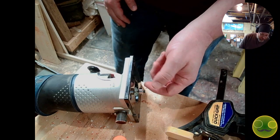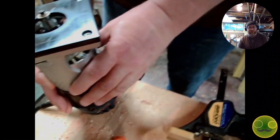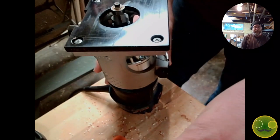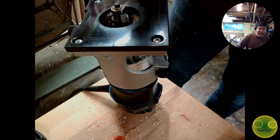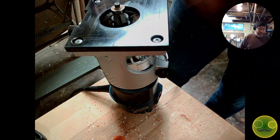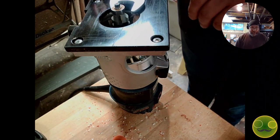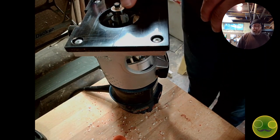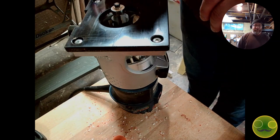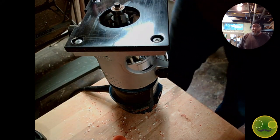And then the roundover bit is here. You can see there's two edges to it, and it's actually cutting the curve onto the face of whatever we roll it up against. Part of the reason I have to sand it before I start is to make sure that the roller doesn't hit bumps, because if it hits something bumpy, then the edge that it cuts will be bumpy.